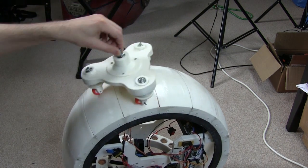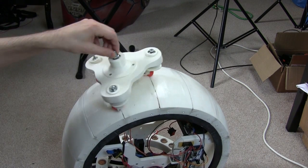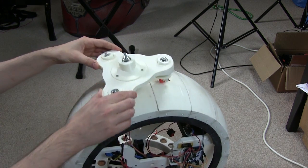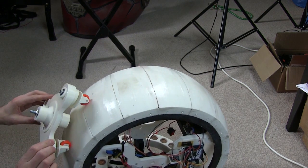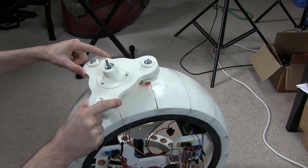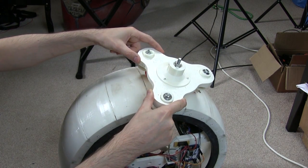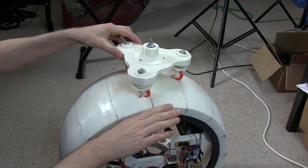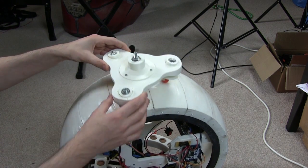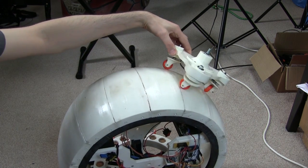As it goes backwards and forwards, it can move all around, the head can stay still, or the head can rotate as it's driving. Now, this will move sideways as well to stabilise as it's driving, which is fine because it's all going in one direction. So all the casters are pointing in one direction, and then it can snake around to drive, and of course it will go slightly wider. At the moment the casters fall off the edge, but when the sides are on the ball, this will have quite a range of movement sideways hopefully, and back to front of course will be pretty much all of this.